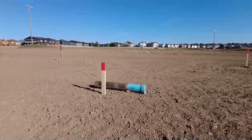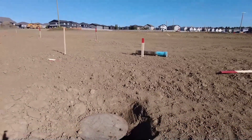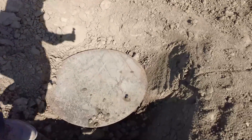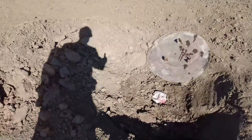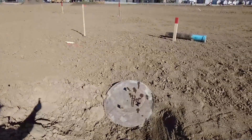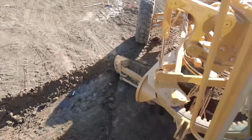Here's another water valve. I'm going to lift the lid and actually show you. There's the valve — it's got a plate on it. It's good to keep a mental note of where all these are on the job. This one I'll probably cover up with dirt and it'll be just fine because it looks like it's probably deep enough. But if you hit those, it's not good — you break them and it's a big fix.